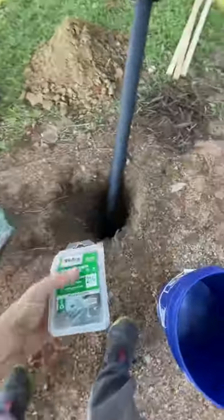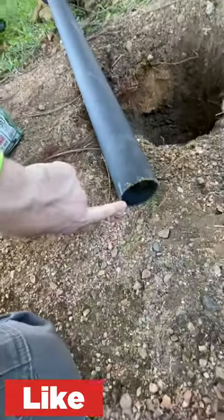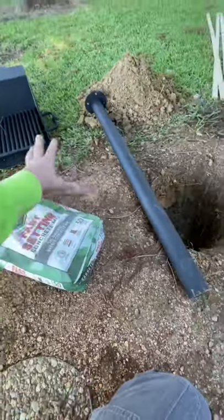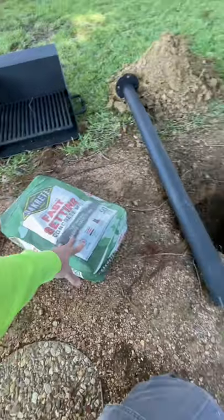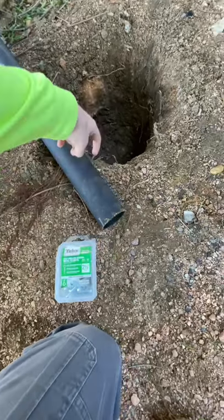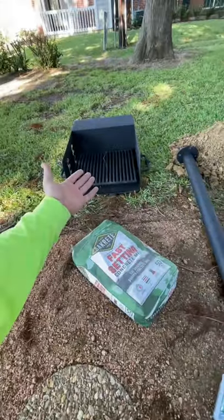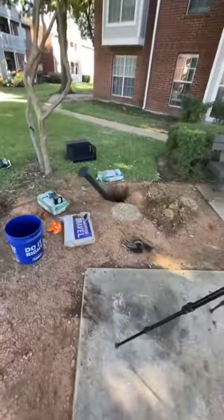What I do for posts — I learned this when I used to work for DirecTV — you don't want the post to sink into the mud or dirt, and you also don't want it to spin over time. Concrete can hold it in place, but over time if people move it, bump into it, or jump on it, it's going to begin to spin and let go of the concrete. So I got two-and-a-half inch self-tapping screws that we put right here at the bottom — about three of them — and that keeps it from spinning. The all-purpose gravel will keep it from sinking into the ground.